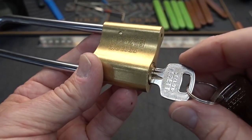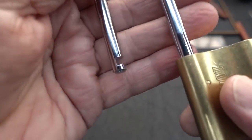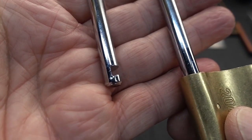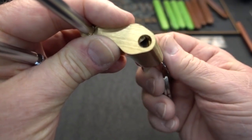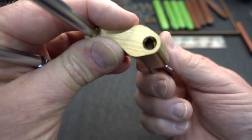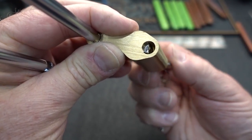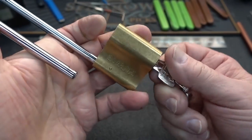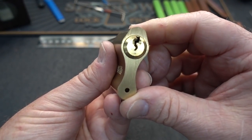When you open these, you slide the key in 90 degrees and it pops out. Now when you see that cut-out, you think, let's just shim that bad boy. But with these LZs, you'll notice how that mechanical block is attached to the actuator — so when we rotate the key, it will positively slide into that groove and lock it up. There's no shimming going to occur on this lock.